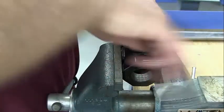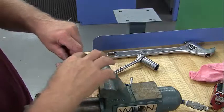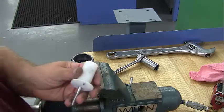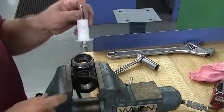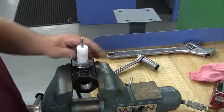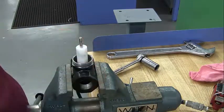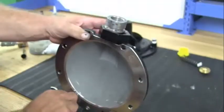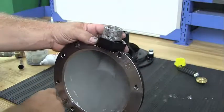Install with your 7/8-inch socket. Next, set your gasket on top of the seat insert. Remove your old plug and insert your new one. When placing the aspirator and plug back inside, the pin should line up with the slot on the right-hand side of the valve. Place your aspirator gasket over the top of the aspirator. Place your union nut back on the bottom half of the body of the valve, and the retaining rings back in their slot.